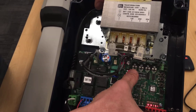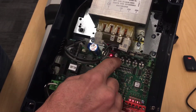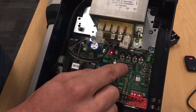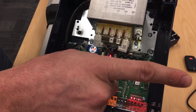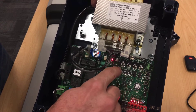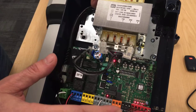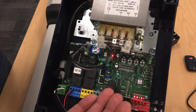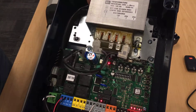There are four different potentiometers, and they all have a little arrow pointing in a direction. You would look at it like a clock — to the left would be 9 o'clock, to the top would be 12 o'clock, and to the right would be 3 o'clock. Your T1 potentiometer is your closed timer. If you don't want a closed timer, turn it all the way counterclockwise and your closed timer would be off. If you turn it all the way clockwise, it will be about 120 seconds.